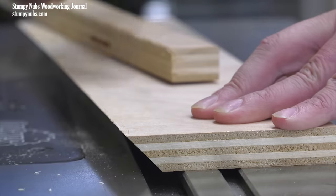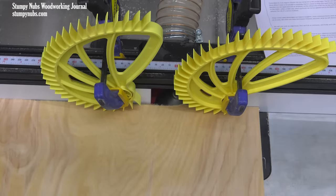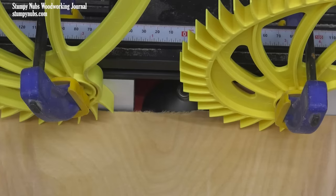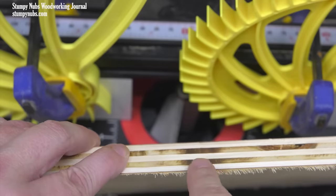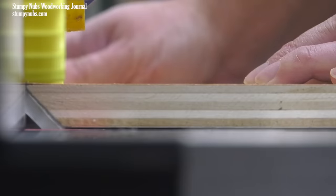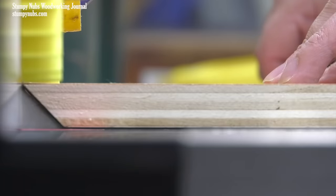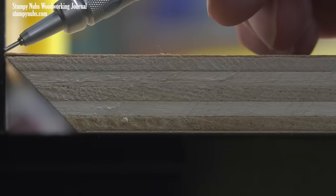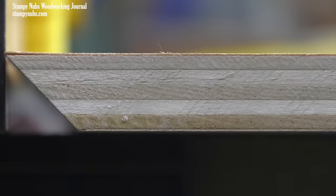Note how both these methods lead to a crisper cut. Here I'm cutting across the grain on some veneered plywood and removing the entire edge — a worst case scenario because that thin outer veneer is so delicate. You can see how I got fuzzy fibers along my sharp edge. If I employ the first method, which leaves that tiny blunt edge, I don't disturb the delicate veneer and my cut is much crisper. That blunt edge, if it's very fine, won't be noticeable after you sand your assembled joint anyway.